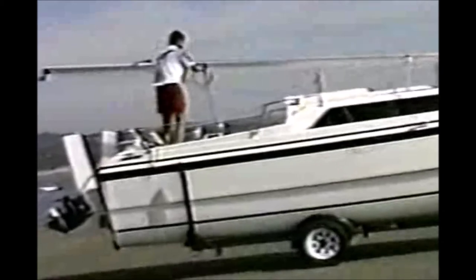I store that dock line right down in the fuel locker on the port side. The next step is to undo the dock line around the aft end of the mast tied off on the two dock cleats. Now I'm going to unbolt the mast crutch bolt, which is used to secure the mast, the aft stay, and the forestay. I just undid the aft stay — there's a piece of Velcro on there. The aft stay stays connected to the back of the boat all the time. The forestay is on the port side of the mast and is also held in a coiled position with a small piece of Velcro.